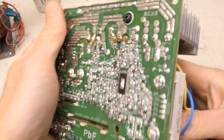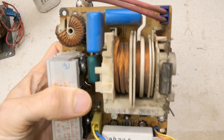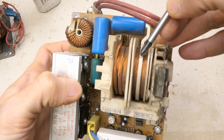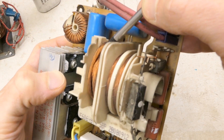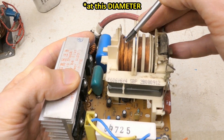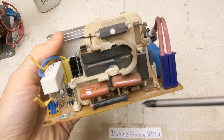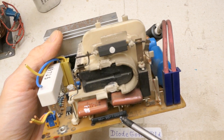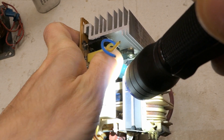There is a lot of control circuitry, especially this chip, some SMD semiconductors, smaller chips, and lots of resistors and capacitors — 'danger high voltage area.' This high-voltage transformer has the secondary split into two sections, probably to reduce voltage between winding layers, and the primary has not that many turns of very thick wire — basically a high-frequency Litz wire made of multiple thinner ones, because at this wire thickness and high frequency the skin effect would be a problem. The transformer has a ferrite core and a high-voltage discharging resistor, looks like 100 megaohms, 30kV rated.